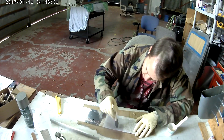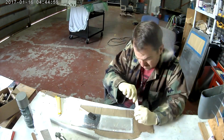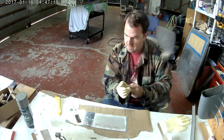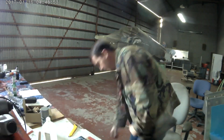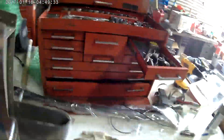Soaked together with hardened epoxy resin, it can be formed into flat sheets, like you see me doing here. It's a simple process: put down the fiberglass, make sure it's straight, make sure you don't bend the weave — you want it nice and perpendicular — soak it with epoxy, make sure it's evenly soaked all the way through, then put another piece of fiberglass on top, more epoxy, fiberglass, epoxy. That's the very simple way of doing it.